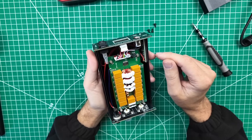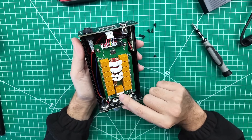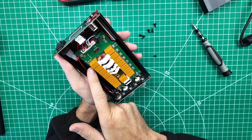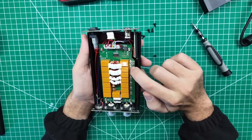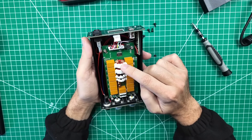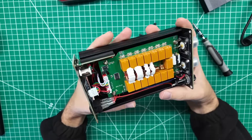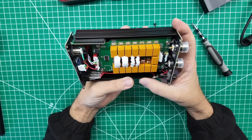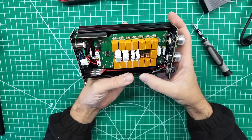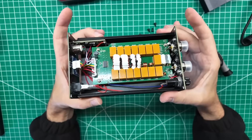180-degree turn through the toroid, then it provides power and ground to the front circuit board faceplate, and then the battery pack. The charging module here is connected to the faceplate for power also — so this is a live PCB right here. Not just a pretty face. Cost savings and space savings. The SWR bridge right here. Capacitors down the side — they actually get physically larger. Inductors down the center: 1, 2, 3, 4, 5, 6, and then there's another one for 7. That looks really well done compared to some of the other clones I have seen. I'm going to put it back together and put this thing on a radio.